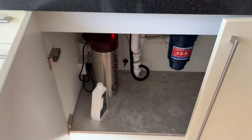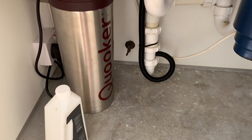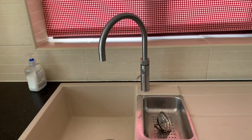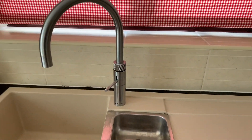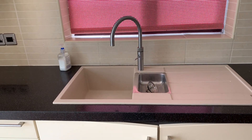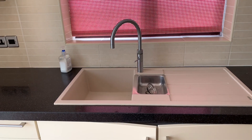The first job is to turn the stop tap off. I've already turned it off but for the purposes of this video I'll go through what we would do. We'd find the stop tap — on this house it's just in this cupboard — turn it off, then open the taps to drain as much water out as we can, then drain the tanks and the cylinder separately.